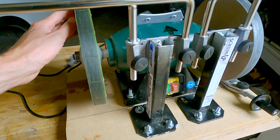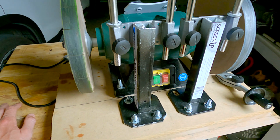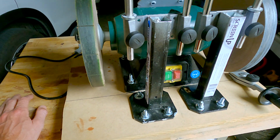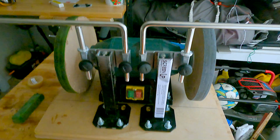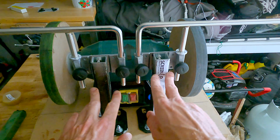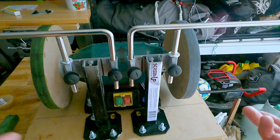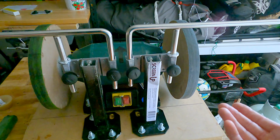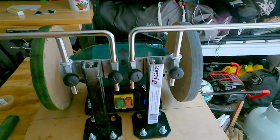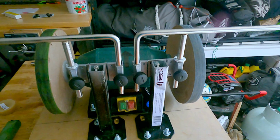The same for this wheel. Left-right wobble, there is a little bit present, but it's not much, and it doesn't bother with sharpening. But yeah, wobble in this plane will mess up your sharpening. And another thing to consider, when you're trying to square the wheel, first install the support and then do the square. Otherwise, there's no reference point of what they're squared in regards to. So once you put the support, then it's gonna be squared to the support. It doesn't mean they're gonna be ideally squared, but in terms of your support, they should be more or less as square as you can get them.